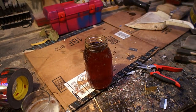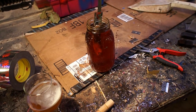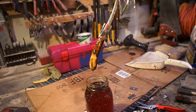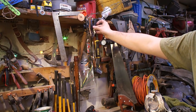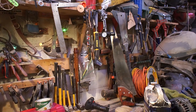I'm using just some regular polyurethane on this one — high gloss since it's going to get wet, figured it might hold up a little bit better. I'm really into dipping my stuff now. I can just hang it up, a little nipple forms on the bottom so you just wipe that up when it's semi-tacky so it'll still smooth out, but it's a really easy finish. I just had to dip it once — didn't even have to do any sanding or polishing in the end.